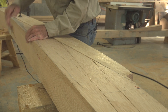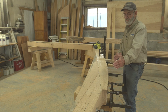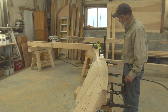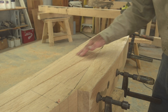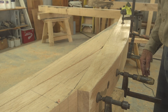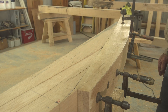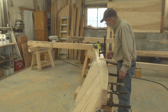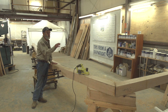There's our spanner in position right there and it looks really healthy in there — look how broad it is. It's going to add a tremendous amount of strength to this area. You have to put some sort of a spanner across it because of this angle. You can see right here the overlap between the forefoot and the keel — this spans across it and really adds strength. It'll be bolted right through there — maybe three of them in there, two more in here, one up there. It's great that it fits that well right off the planer. The next thing for us to do on this is join the stem and the forefoot.